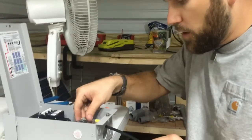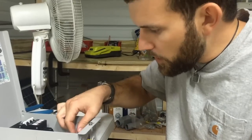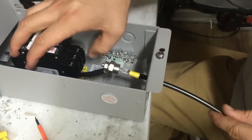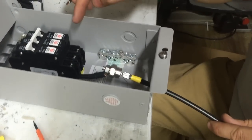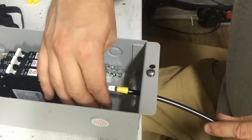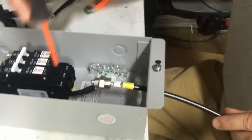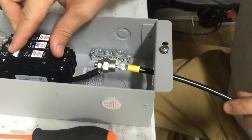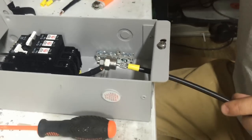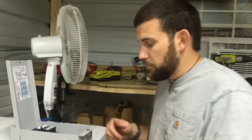At that point, we've crimped our wire back in place — you can heat shrink that too, just like we did the other. Push that into place, under the breaker. You can see there's plenty of room, and the way we've designed it, the diode is lifted up out of the way of bus bars, grounding equipment, and so on. Then all you would do is tighten that down. These breakers would obviously be off at this point, so you just flip your breaker back on and your system would be up and running again, as far as your solar not bleeding back.